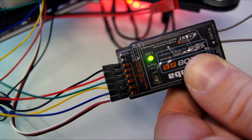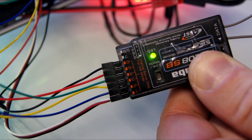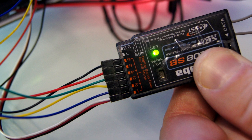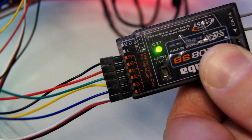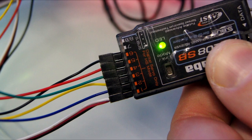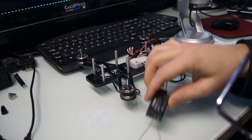The servo cable that has red, white and black is plugged into port 1. Then I have blue into 2, yellow into 3, green into 4, red into 5 and black into port 6. I'll put a link in the description to the Lumenier website so you can set this up depending on your receiver.